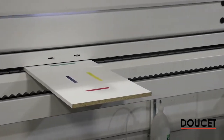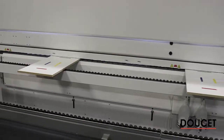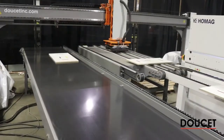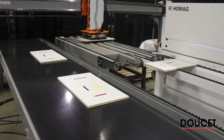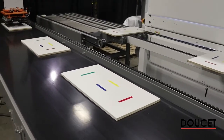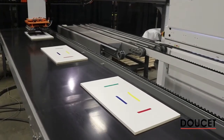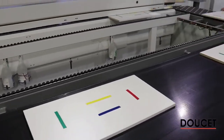The first sequence is in batch mode. The operator activates the green light behind him and now he's going to pass all the green tape — that's pass number one for those panels. As the pieces are fed through, we locate those parts, which is why you can see an acceleration on the belt conveyor to locate the part as quickly as possible. The gantry head is designed to do up to 12 cycles per minute on a returning cycle, and a minimum of 7 pieces per minute in stacking mode — limited to 7 because of the time needed when stacking at the lowest height level.